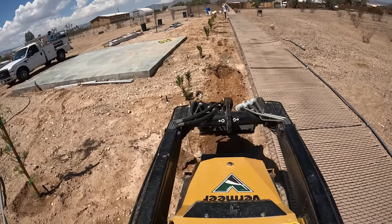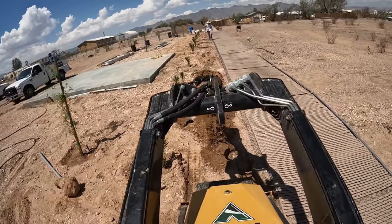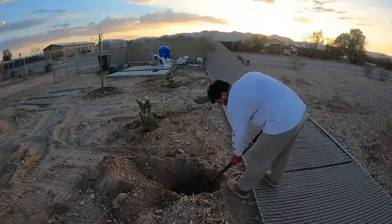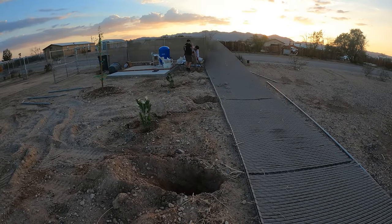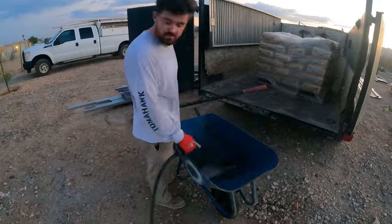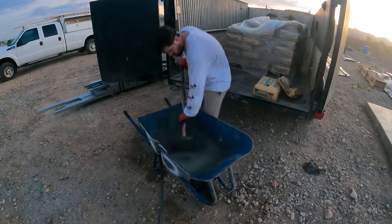I am making these holes a little bigger than they were previously. I don't know that any kind of fencing would have held up with the conditions we had here. When you look at a fence as a complete system — meaning all the posts working together as one unit — if even just one post fails in a run like this, that puts undue pressure against all the other posts. So the whole system fails. You're only as good as your weakest link.